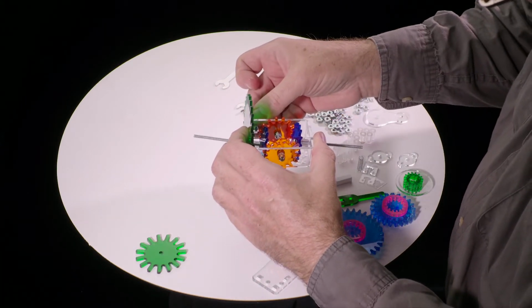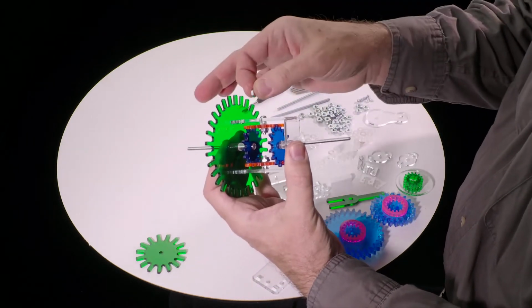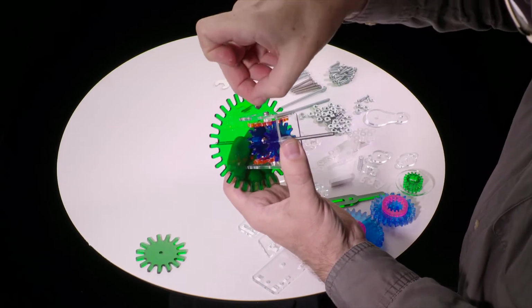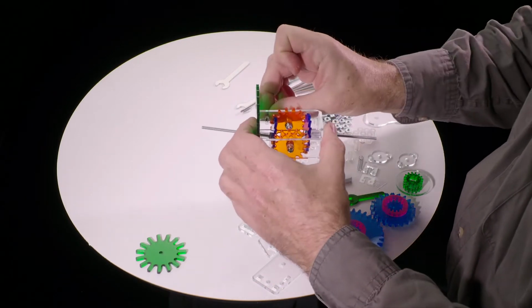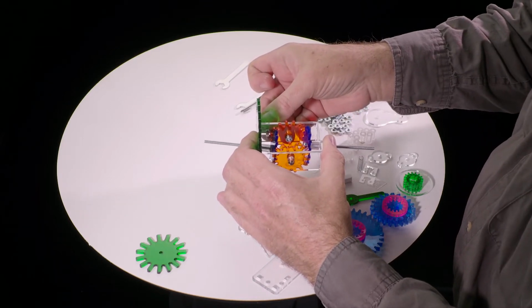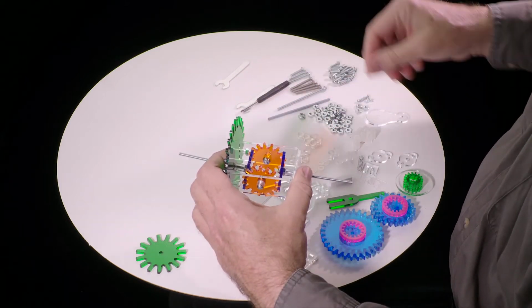And then you have to press this together and take one of the regular nuts, and you see there's these T-slots here. We want to slide a nut into one of those T-slots. And sometimes you have to push a little bit. If you find you're having to push a lot, like it just doesn't want to go in, that's because it's not rotated right. You need to rotate it so the flat sides of the nut are going in sort of parallel into the side. And it shouldn't take much force. Often they'll actually just fall right out. They fit completely loosely, which is why I'm holding it sideways like that so it doesn't fall out.